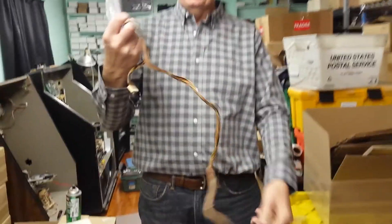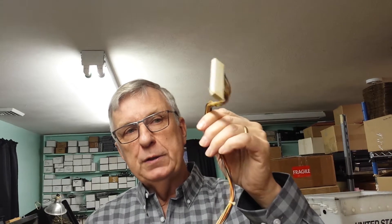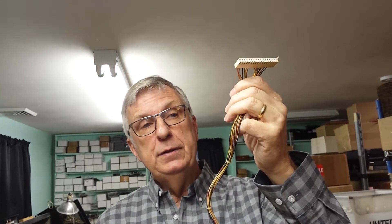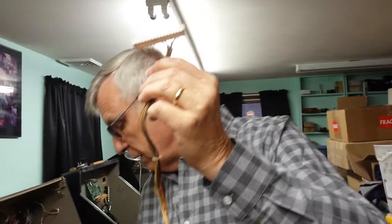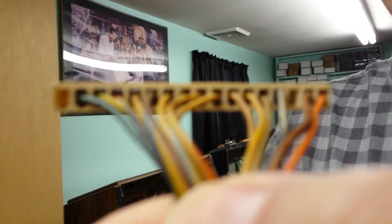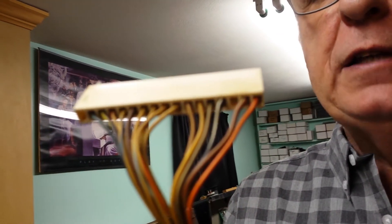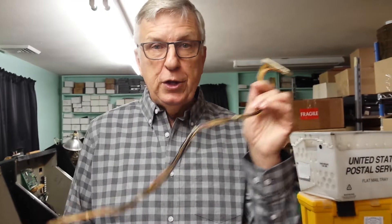It's in the harness that goes from the MEC control board up to the central control computer. This harness communicates with the MEC control board, which tells the motors to start or stop. When the microswitch releases the signal to go to the motors and the motors activate, there's been a hesitation — caused by oxidized contacts, the pins within the plugs. These pins are communicating from the computer to the MEC board, going from 8 volts or 28 volts to zero, activating switches through transistors on the central control computer. So 50% of the time, your problem is not in your circuit boards — it's in the harness.